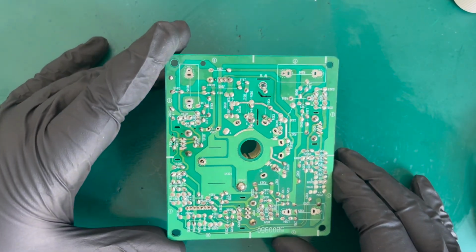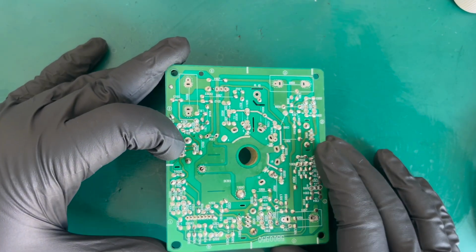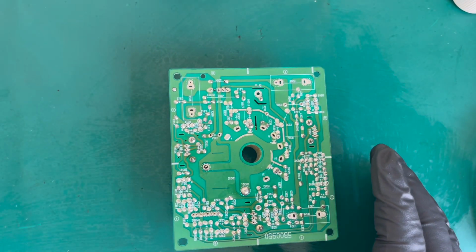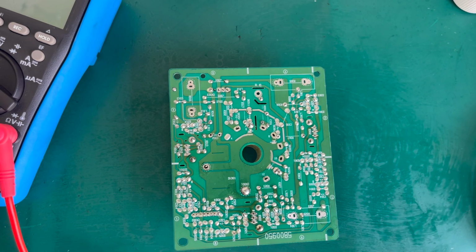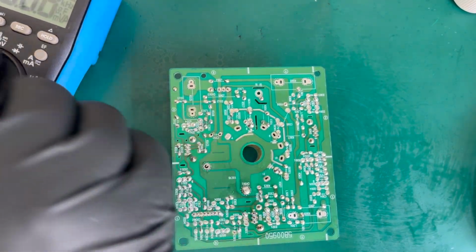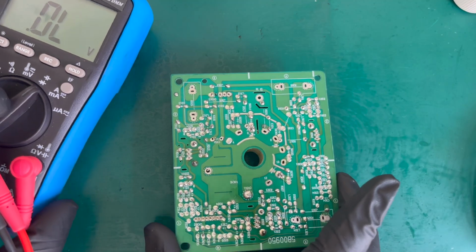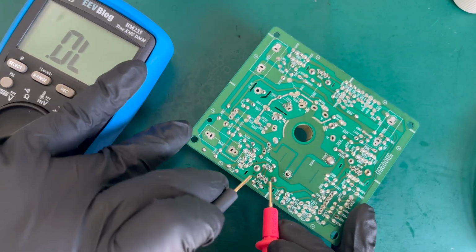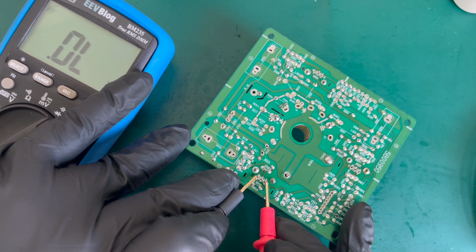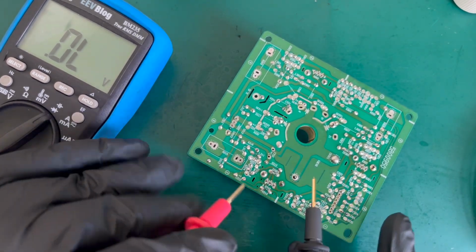Just before we get back into resoldering up some of these bits and pieces now, obviously you saw me desolder the transistors for the red, green, blue. And we'll bring the multimeter in, and I don't know offhand what the specific voltage drops should be, but as long as we see them and we don't see it in the other direction, they should be fine. So we'll turn the multimeter to diode mode there. You can see it's on diode mode. And we'll just go leg to leg on these transistors. So we will try and go that way. Okay, nothing, nothing, nothing. I'll go back the other way.